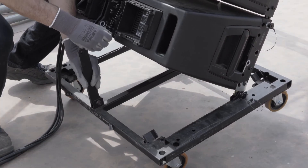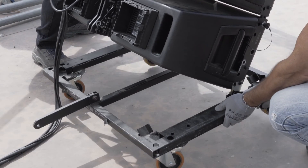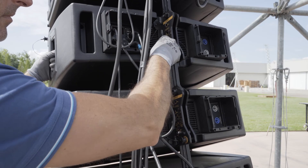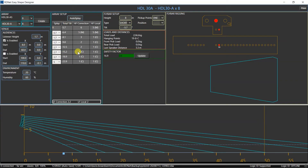Remove the cart, always starting from the rear first, and, as for the first four modules, insert the compression pins on the left side — the one with the yellow writing — in the position corresponding to the pins inserted on the right side. In our case, C2.7, C3.7, and C5.